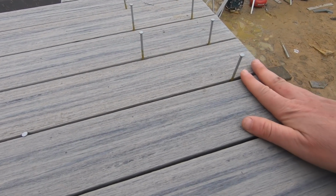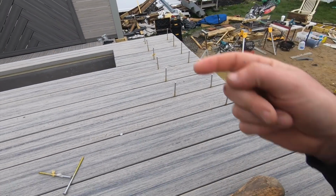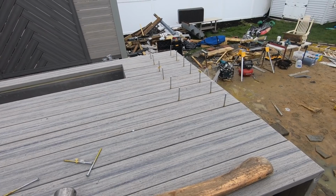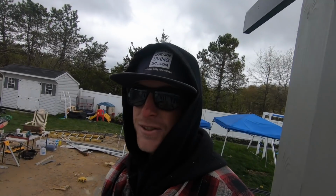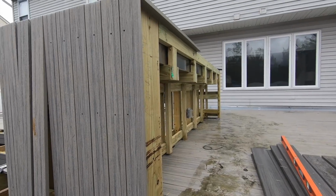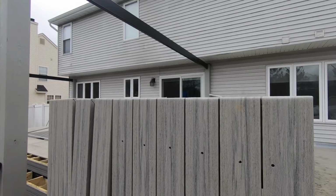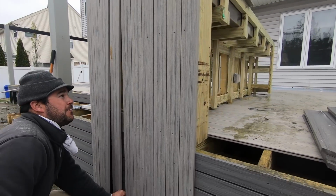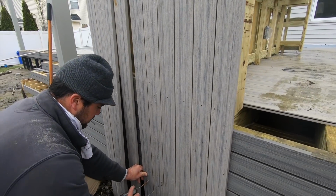We're just about ready to start installing these, so we're putting these in. These are gonna be our spacers, and we just wanna double check all of our spacing, make sure we've got a similar overhang on both sides, and then we can make some adjustments. Whew. Did good. It looks freaking awesome. We are getting our first side done here, and you can see this nice waterfall edge. Looks really sweet. And then it overlaps our horizontal Sierra boards.